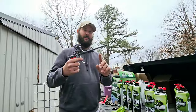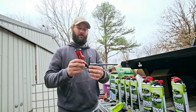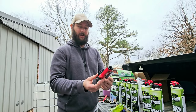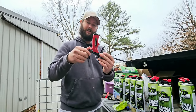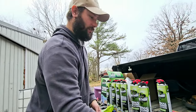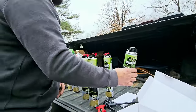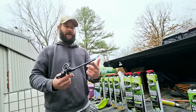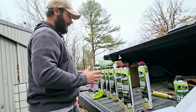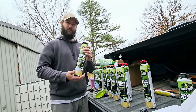I'm going to show you what's included in the kit, talk about how much it costs, and then insulate my storage shed. Got the spray gun here — this is how we apply the spray foam. We attach the can right here and there's a regulator so we can adjust the amount of spray foam by turning it clockwise or counterclockwise. There's also foam cleaner included, so when you're done using the spray gun you can clean it and reuse it. This kit is around $250 and each can covers about 20 square feet.